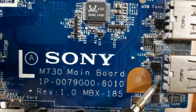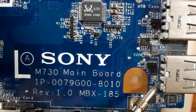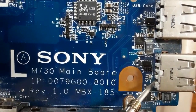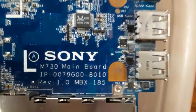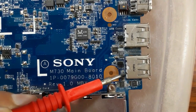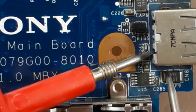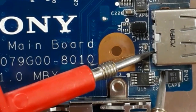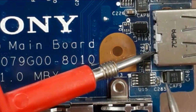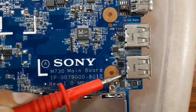This pin here is pin number one, pin number two, three and four. So this means five volts. It should be connected to the place of the chemical capacitor. The place of the chemical capacitor is here, as you see. So pin number one is connected to the place of the chemical capacitor, exactly as we have seen in the circuit diagram.